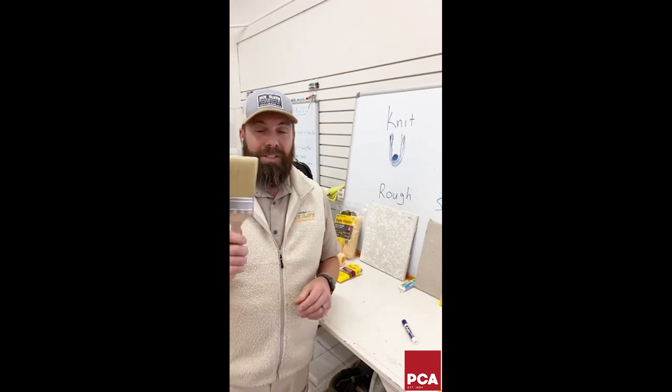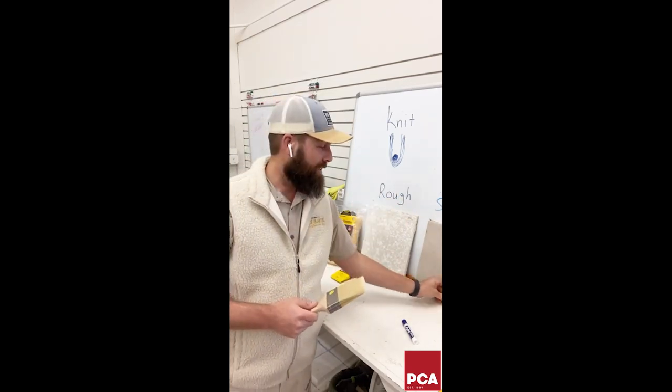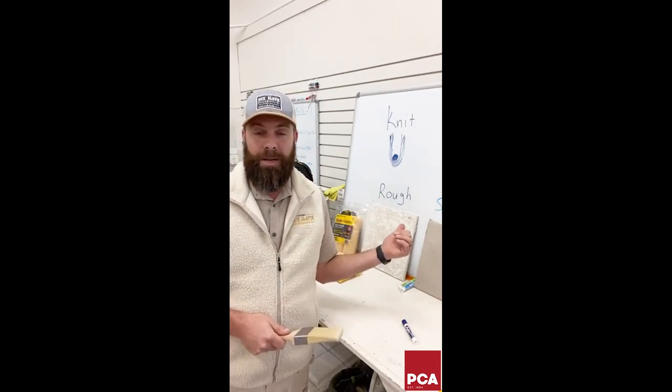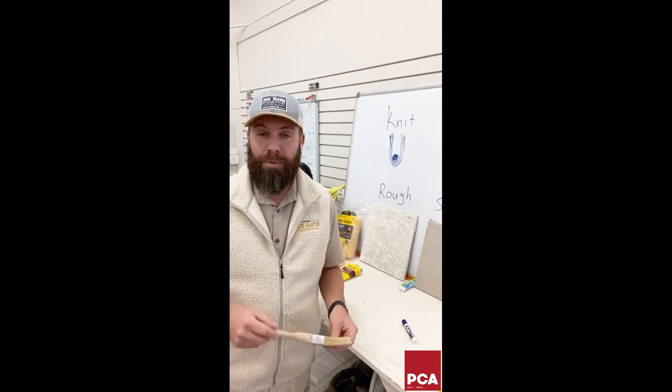In time trials with old stucco and very rough wood, the right tools seriously make a difference. The thinking is: stiffer bristles give more production and better coverage on rough surfaces. That's the idea behind knit roller covers and extra stiff bristle brushes. Purdy has lots of options; these are the ones I've landed on over the years for being super productive and long-lasting.